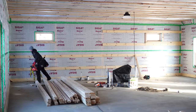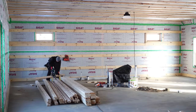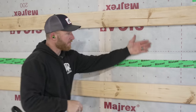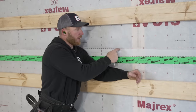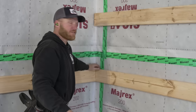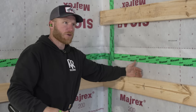Greg has installed these girts while I've been working on these walls. This is our service cavity — this inch and a half is where we can mount boxes, run conduit, and run wiring without having to penetrate this system. Some things are tricky — corners have to be taken care of because your pipe has to go around the corner, or we have to come through some interior walls. The goal is to reduce any penetrations to this layer, which is why post frame is awesome.